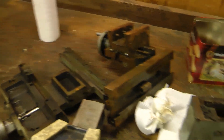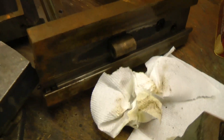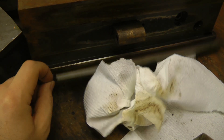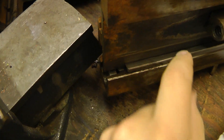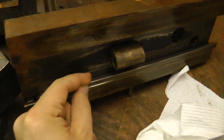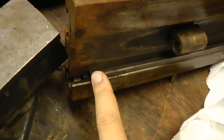I've pulled off and disassembled the apron here. It's pretty dirty and definitely needs a good cleaning. A few problems on this — this wedge piece that controls the tension is cracked so it doesn't touch the screw, and it tends to get pulled back and wedge the thing too tight. I'll have to weld on little extensions for that.